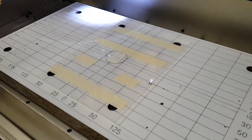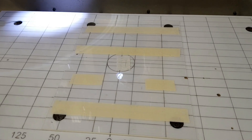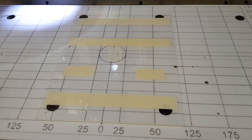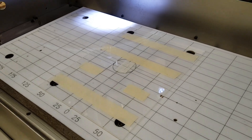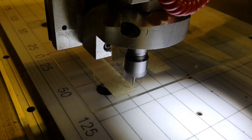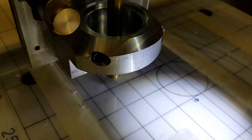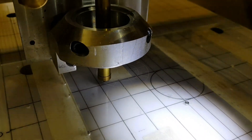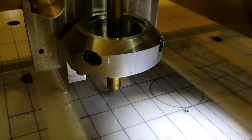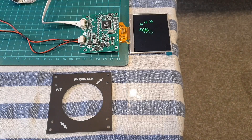Some acrylic I've had before didn't machine well because of the melting point of extruded acrylic, so for this one — since we're going to engrave it and want clear lines — I've sourced a small amount of cast acrylic to see what difference that makes. The piece is cut twice: first using a V-bit, and then a second time using a drag tool, which is the first time it's been used for any of the sim pit panels. The idea is to compare how much finer the drag tool can make those lines versus the V-bit.